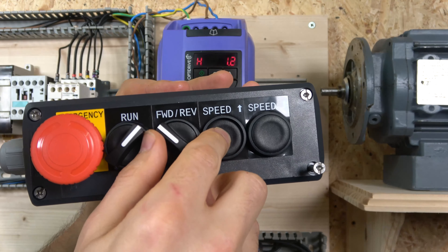So with the drive in remote mode showing zero frequency: pressing speed one gives 15 Hz, taking speed one off and pressing speed two gives 25 Hz, and pressing speed three jumps straight to 50 Hz. These are all preset via P21, P22, and P23 following the manual rules. Pressing speed one and speed two together gives a fourth speed — in our case 35 Hz. Then closing terminal 6 takes you to the max speed, though the interaction between that button and the others can be confusing.